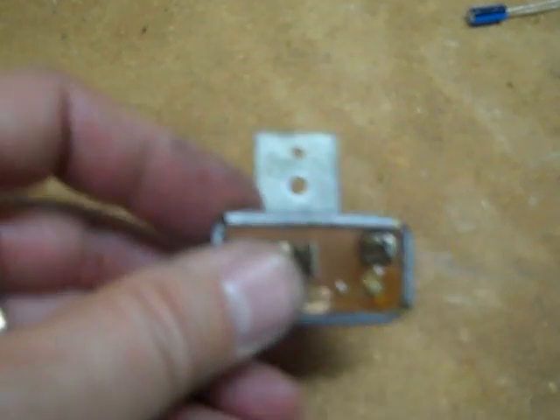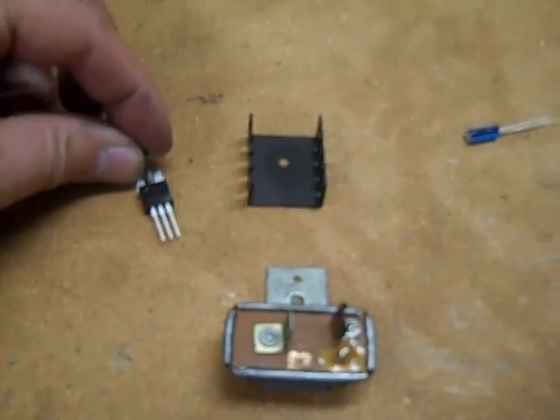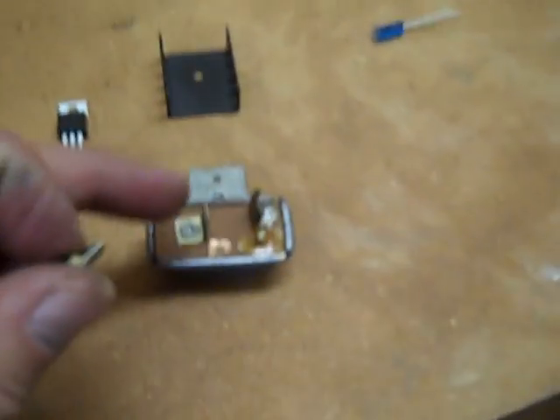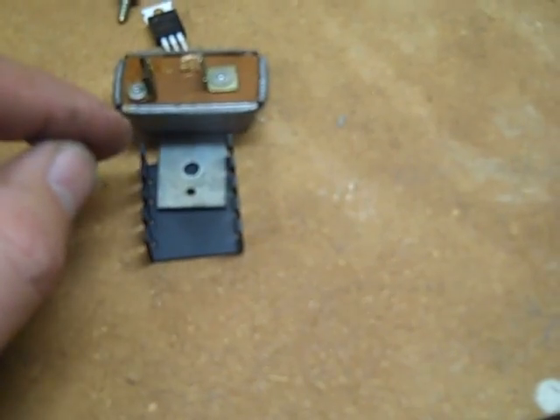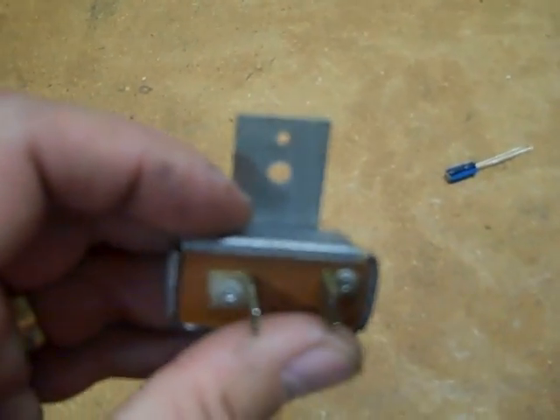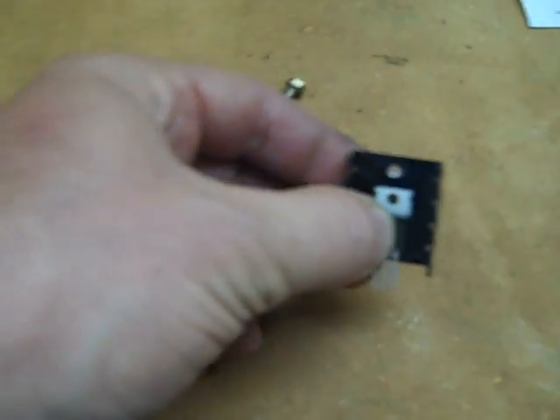All this stuff is about $10. Now, if you look at the old regulator, it has two holes — the big one's where the screw went through, and the little one's an index hole where a tab stabilized it. Here's my heat sink, and the screw that held the old regulator in will also go through my IC chip and heat sink. I'm going to use the old regulator as my template, trace the holes, and drill a matching hole. Got her drilled — now I've got my two holes similar to the original.